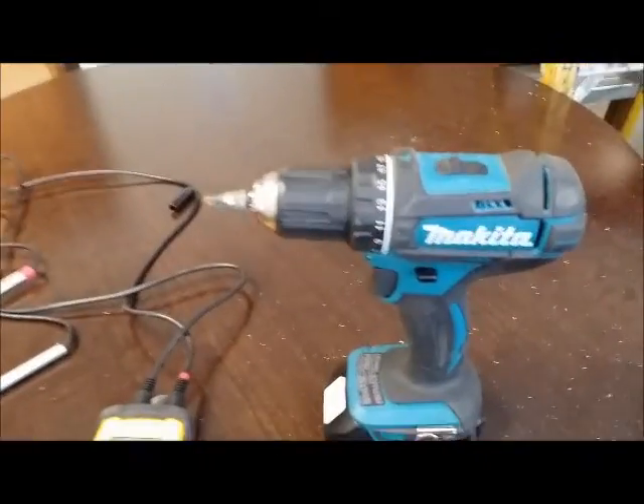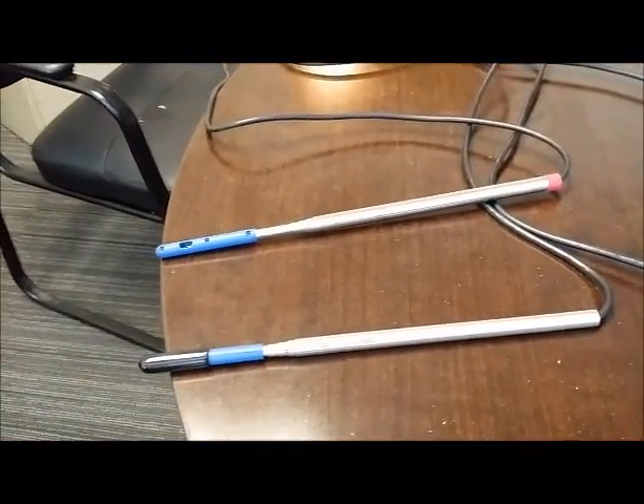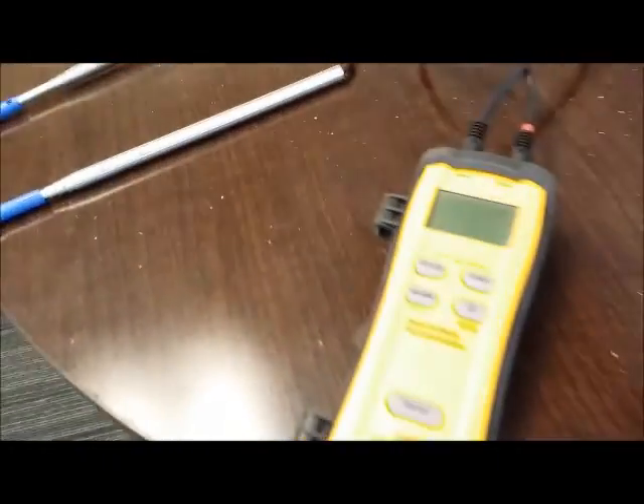This is before and after the coil, or the air handler. It's really close to the air handler actually — the coil is right on the wall there. So that's where I'm going to make my hole. I'm going to use this drill bit, just make a small little hole, big enough only to put the probes in, and then I'm going to take the readings.